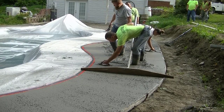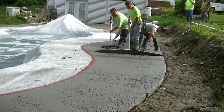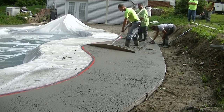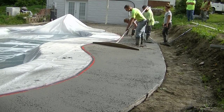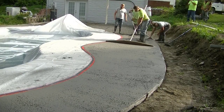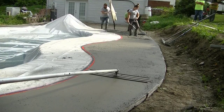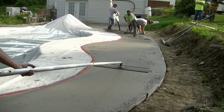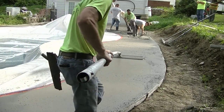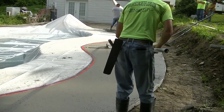Then we put our wire mesh in there and we put what's called slab bolsters under the wire mesh to keep it up off the ground. So now we're just extending the concrete patio out about four to five feet in most spots, and then we're adding an existing larger patio onto the back of the house. I'm using my five-foot stand-up screed to go around most of this, and we're going to stamp this — make sure you hang out to the end of the video so you can see what it looked like. It turned out really great.